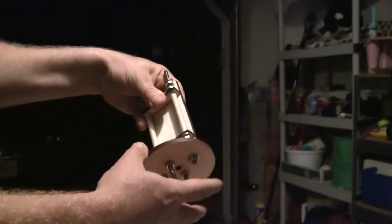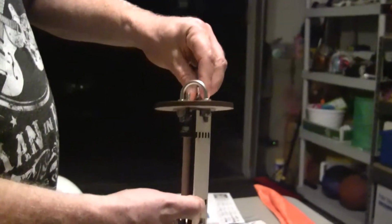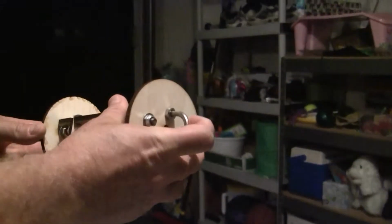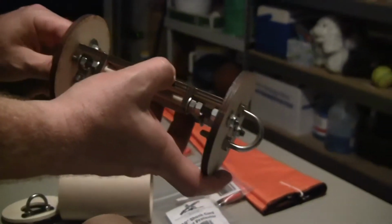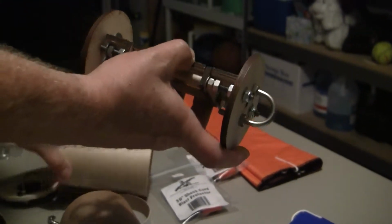The way all this works is there's an altimeter bay. That's what goes in here. The altimeter bay goes together like so. We put the wing nuts on like so. I won't spend a lot of time on this, but once we've switched the eye bolts to the U-bolts, we'll bolt the altimeter board. So it's a pretty small board, a 9-volt battery, and wires. They come out both ends of the bulkhead. Once it's put together, this seals the electronics so they're not exposed to the gases.